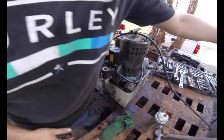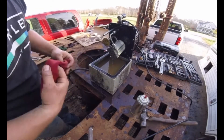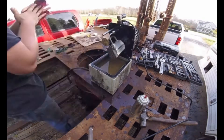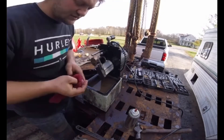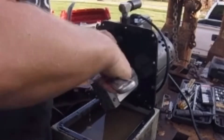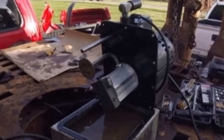Part two — we're working on the hydraulic pump. I tested it and thought I was done, thought I had it all figured out, but it wasn't building enough pressure to run the hydraulics. So I had to take the pump apart and figure out what was going on. It did have a couple of broken springs and needed to be gone through. First, you have to take off this 90-degree elbow. Take that loose first — you can't take the pump off without taking that elbow off.